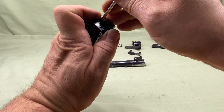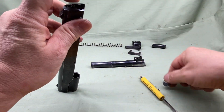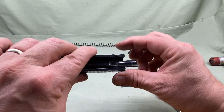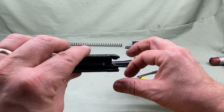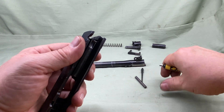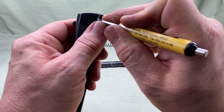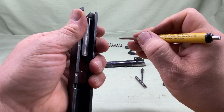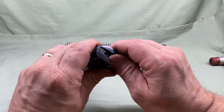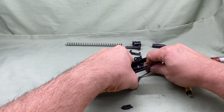Now the plate's not going and it's nothing to do with the firing pin - it's the ejector. So I'm going to remove it all and double-check my clearances. It's a little bit too far - I had a feeling. So I'm just going to back it out ever so slightly. You can even keep the firing pin out and check it first. It should go - and see how it went in nice and easy, slid right out. Now I'm good to go. I should have done it the first time around.